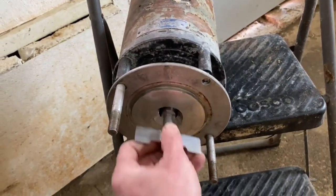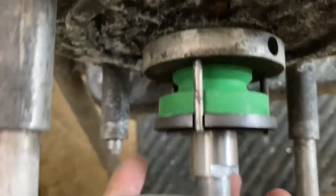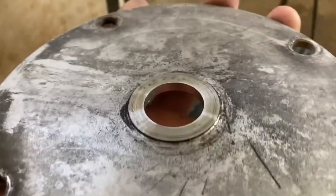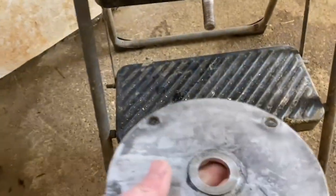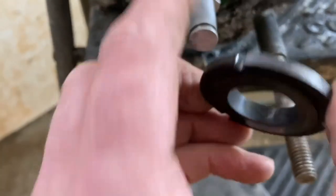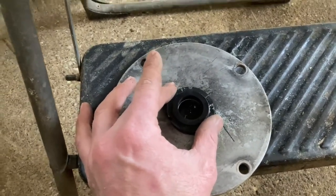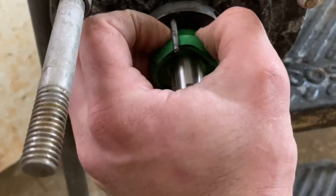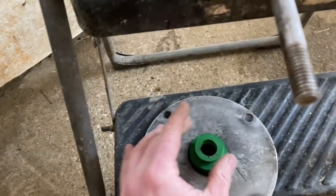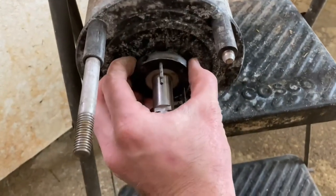So we're going to pop this impeller off and then this plate should come loose. It's important that this is machined really well because it seals against the ceramic piece, which also seals against the rubber piece — the hard part is getting the ceramic piece to seal against the plate. We got a new one of those too. We'll pop this rubber piece off, then there's a collar with an allen screw in the middle — two allen screws — and we'll slide that piece off, put the studs in the new one, and start putting it all back together.